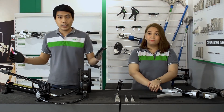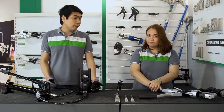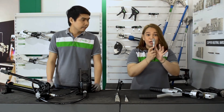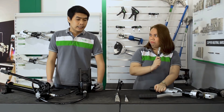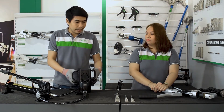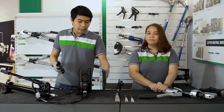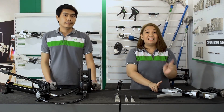The good thing about these hydraulic crimping tools from MacGill is that they come with an extra sealing ring when you purchase them. Last question: what if the barrel develops ears and wings after crimping? The reasons could be over-crimping or a mismatch between the size of the crimping die and the crimping lug. That is why it is very important to properly size the crimping die based on the size of the crimping lug.